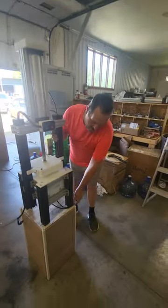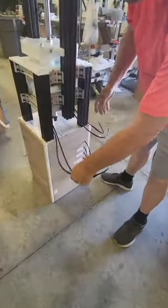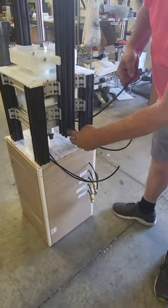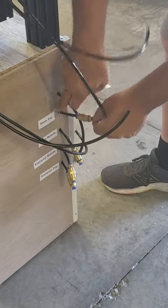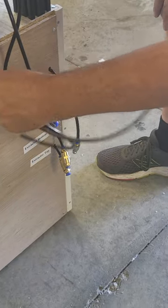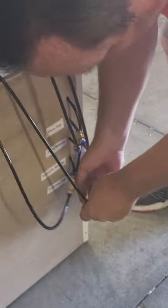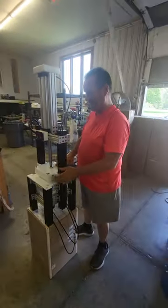On the other side you have four hoses coming out. The two on the bottom are your extractor hoses; the others are your press hoses — press top and press bottom. Just plug your press top into where it says press top, press bottom into where it says press bottom. Your extractor bottom hose plugs into extractor bottom, and the top plugs into extractor top. Once you've done that, your mold is lined up.